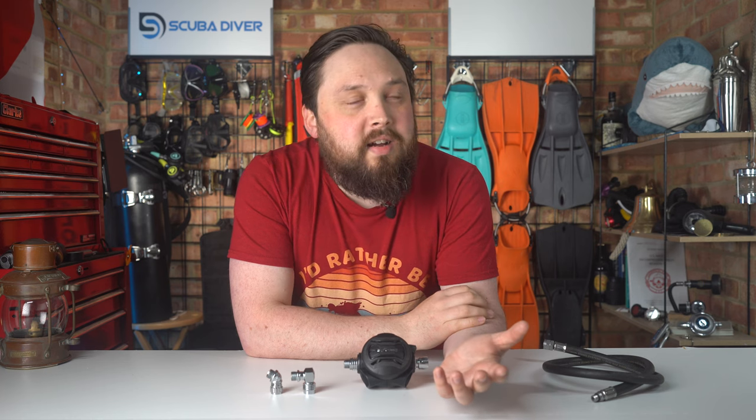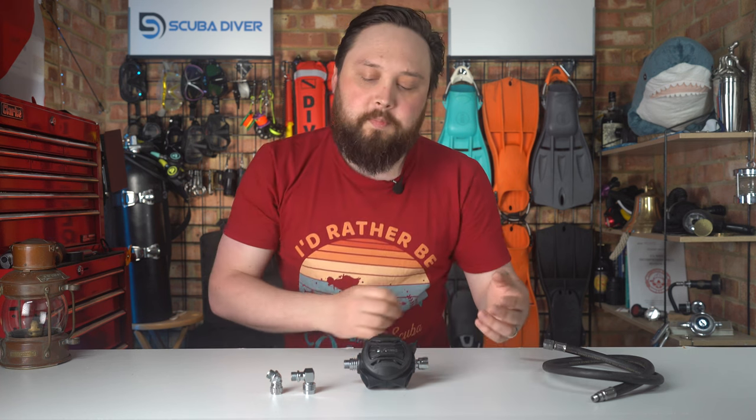There's nothing wrong with swivel joints as long as you do keep up with them. Technically, you're adding that third extra O-ring seal compared to a fixed 90-degree angle elbow. The benefit is that the hose can come out at any angle with an omni swivel or similar. It's cool, but if you don't need absolutely every angle, then a 90-degree elbow or 120 is usually a lot cheaper and a little bit safer.